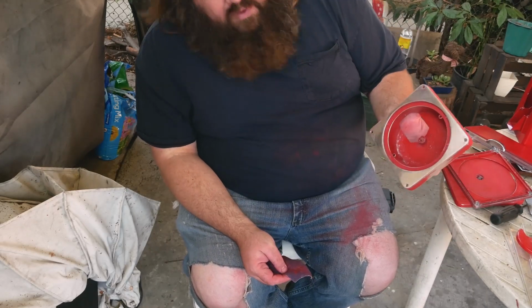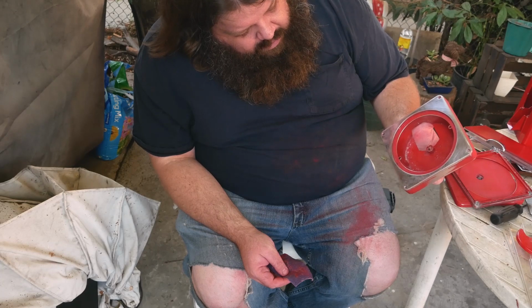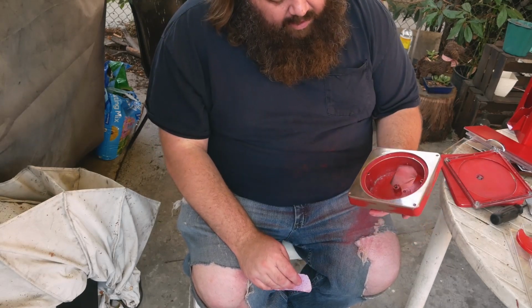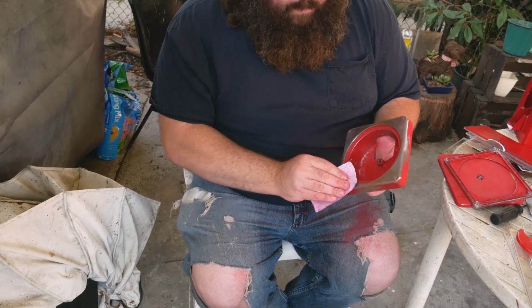And if you're curious, when you see me hold it up to the light with my head at a tilt, I'm looking for all the shiny spots. Any shiny spot is a place where paint won't really adhere well. If your machine happens to have chrome or polish on it, this is something you need to do, because if you don't, again, the paint won't adhere.